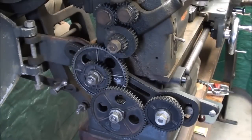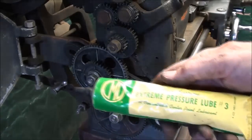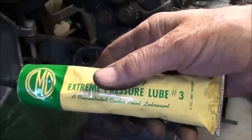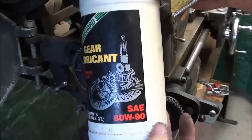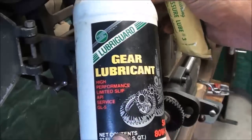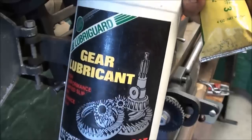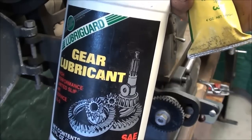It's ready to test and see if I'm truly at 20 threads per inch. Let me talk just a little bit about lubrication. Some people just use oil, and it's certainly better than nothing. But an excellent gear lube is CMD extreme pressure lube number 3, anti-scoring. I also use this for threading and used to use it for dead centers. At the very least, use some kind of gear lubricant — this 80-to-90 weight is easily available in any auto parts store. It really clings to the gears and doesn't fall off like a regular thin oil.